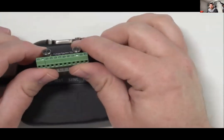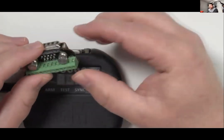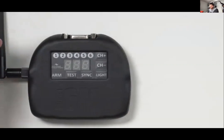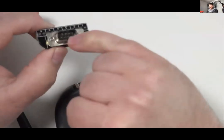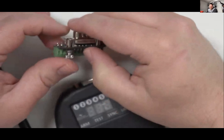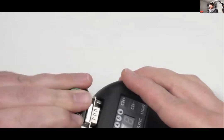For customers that do special effects — the cool thing is you can go ahead and wire up an actor with squibs prior to the shoot. You don't have to worry about having a module on them. You can turn the power off and do all the safety stuff, with your remote being the one that actually fires. You can also completely remove the module from the terminal block and use our DB9 shunts to completely shunt the circuit, preventing any static discharge from building up in your igniters and causing them to fire inadvertently.